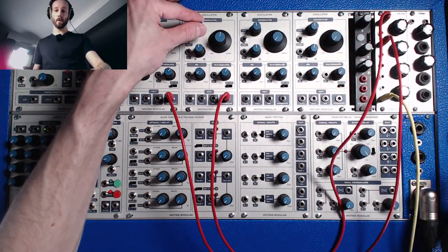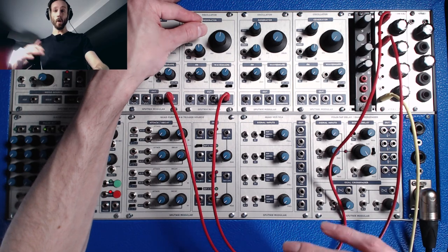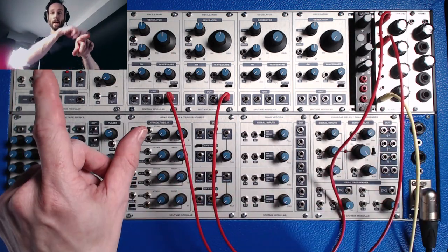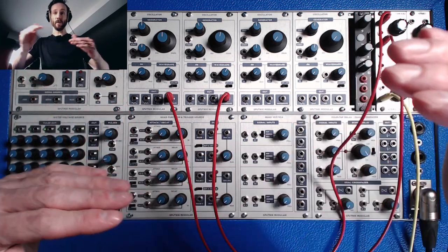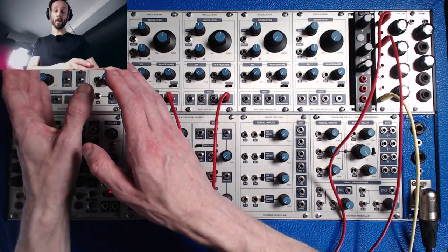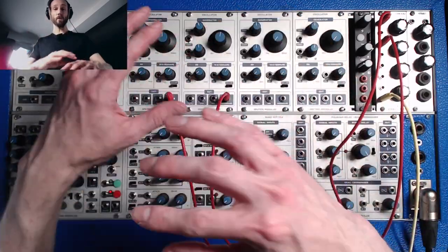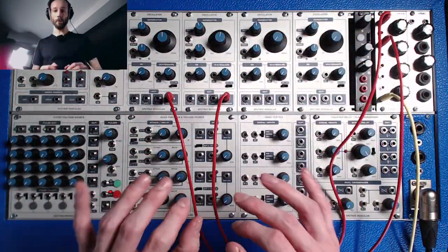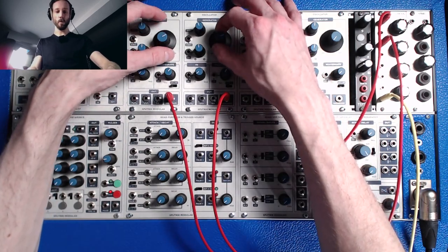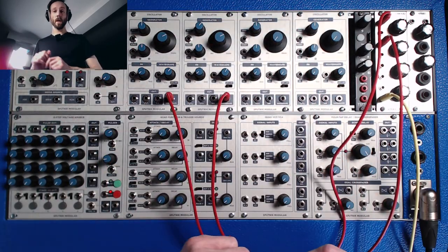If you detune it a little bit, you hear the pitch or the volume change a little bit, and that's because you have a wave shape and another wave shape on top, and sometimes they will lower each other's volume. It's especially obvious in low frequency sounds, because the wave shapes are very long, and the time it gets lower in volume is more pronounced. So we have an oscillator.